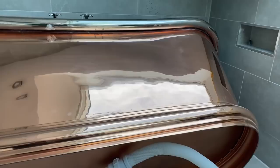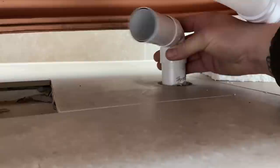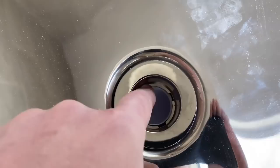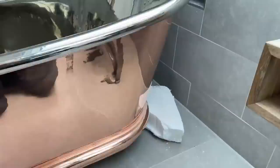Here's the gap we've got to connect this waste underneath the bath. We've got the waste coming out of the floor, we're going to get an elbow, a little bit of pipe onto there, and then this flexi will connect at the end. After we've done that we can drop the bath down, I can put some water through it, and then lift up that end ever so slightly and just check that the trap's not leaking. I've got my reservations with it. The washer looks like it's clamped on but until we put some water down it, we won't know.